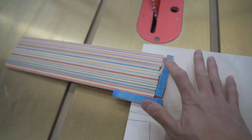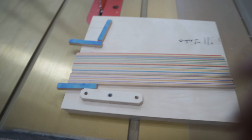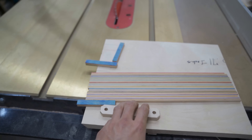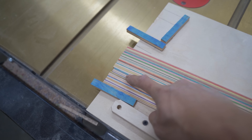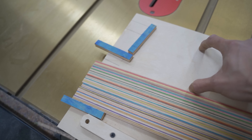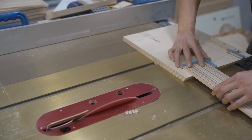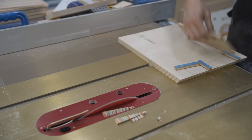This is the final jig. The dado goes face down on this side for a nice clean cut. You flip it — dado still down — lean it against the stop block and cut. Then back over, dado right here against this side, face down, and cut. I also added a pull handle here so I can use one hand to guide the piece. If this feels too close for comfort, you can always use toggle clamps to secure the piece.